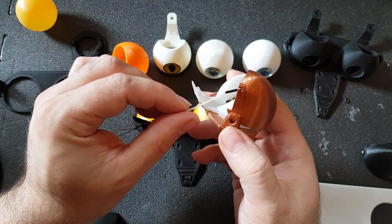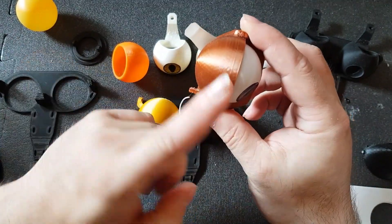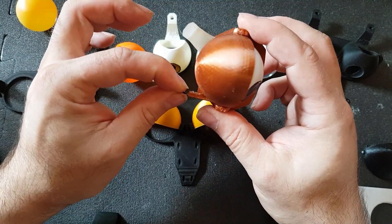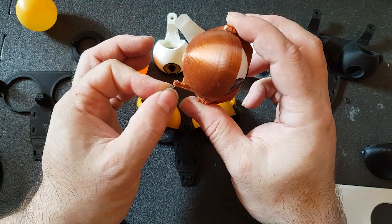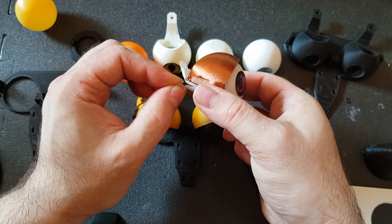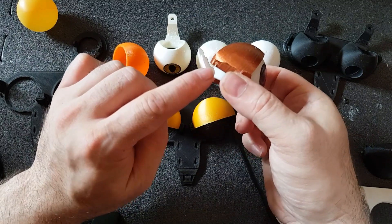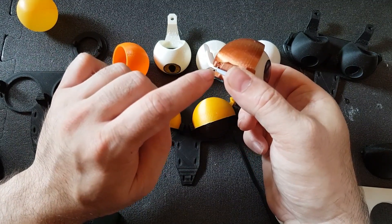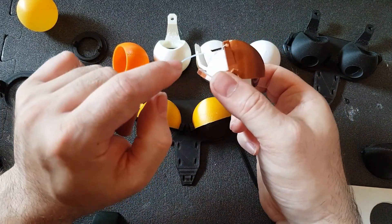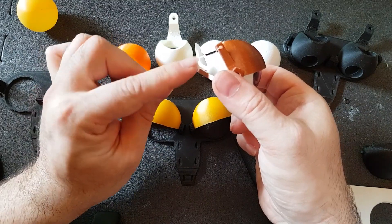Pushing and pulling on the lever is something you should always do in the direction 90 degrees to the center of rotation — so you want to push and pull like this, not like that. That's not gonna work. From the sides you want to push and pull directly in the direction where the hole is moving. You have the minimum position, you have the maximum position — draw a line between those two points and you know where you want the cable to go.